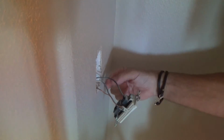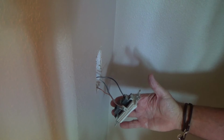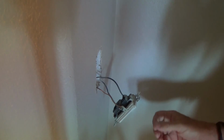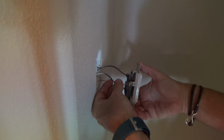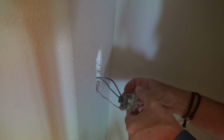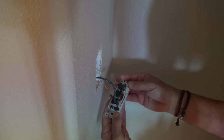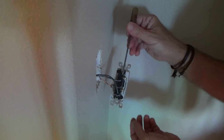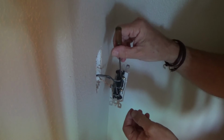We'll open up the other switch and I'll see. Most of the time you get light switches and you've got 2 black wires. One black wire is the power coming into the light switch, and then one black wire goes from this box on up to your ceiling light fixture. Okay, and that's generally all there is to that. And I look on the side of there and see if you really wanted to save everything on here. It's kind of hard to see, but I could take my little small screwdriver, and there's a hole there.